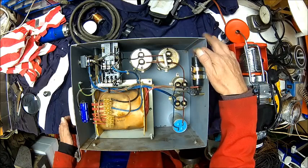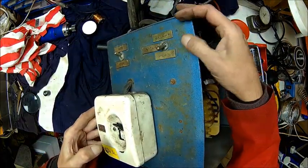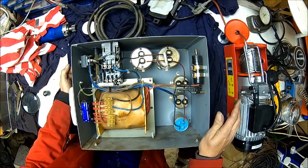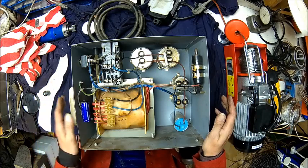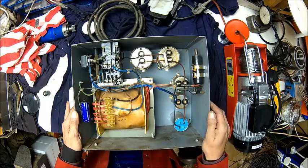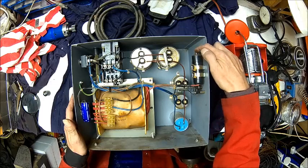When you pull in the inrush current, it puts in extra capacitors and then releases them. It's got a switch on the side which sets different values, and on the left hand side there is a start switch which pulls in the contactor and the extra capacitors. Pretty much the same as the transwave, just a bit of an older design with the current sensing via a simple coil. The current goes through and that just pulls the plunger.